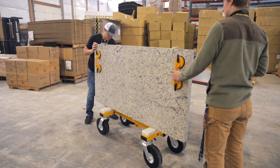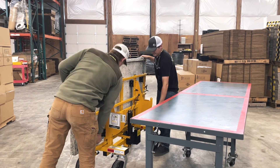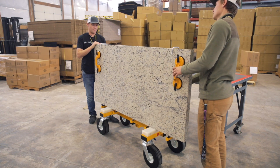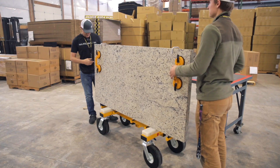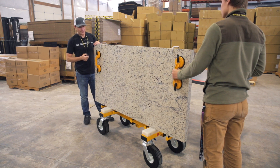To begin the lift, we want to push the lifter feet all the way out so they can lift the countertop. Next, we want to loosen the handle on the shepherd hook so that they move freely once in the horizontal position. From there, we use the remote control to lift the countertop up to cabinet height.